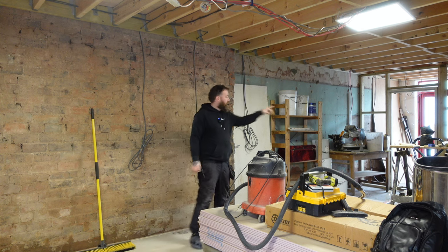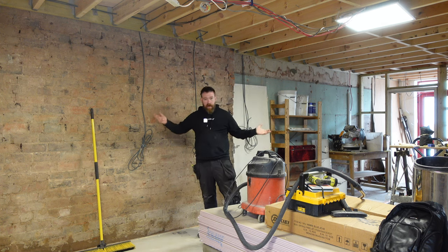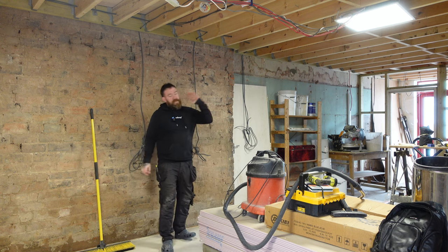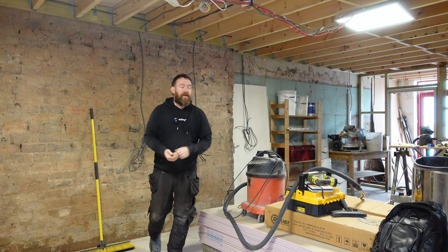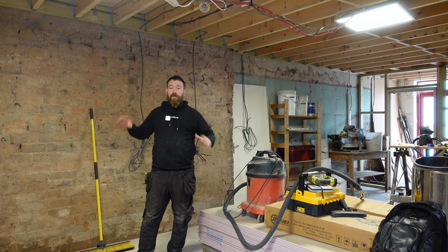Currently there's no spec for heaters, so I don't know the wattage or anything — just the locations. By the front of the property in the lounge area there's a heater under that big window, that's number one. Number two in the lounge-kitchen-dining area is here. I've wired both separately back to the board. For the heaters at the back, I don't want to wire them separately if possible. The bathroom heater will go on its own spur just outside the bathroom.